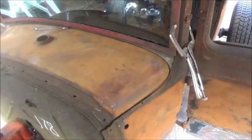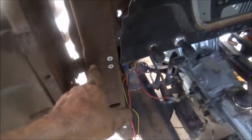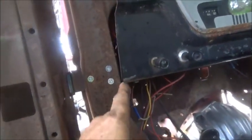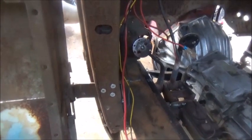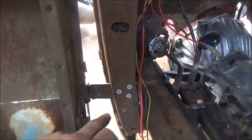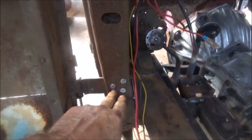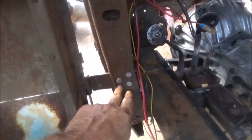It's kind of weird because what I've done here, I went ahead and drilled and went with 1/4 coarse thread. Of course, 20 is coarse thread, so that's what I went with on the hinges. But the original hinges had 5/16 coarse. What is it, 5/16-18, I think. But they had coarse thread. But if you get a 5/16 bolt countersink, the head's way too big.